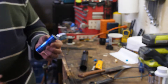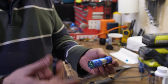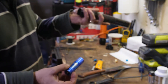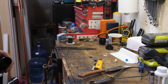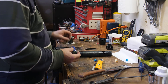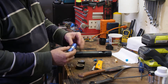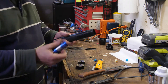These aren't standardized — manufacturers make them in all kinds of different dimensions, that's if you can find them. You can see I've got quite a bit of slop between the maglite body and the rest of the assembly. So we're going to pull out the secret weapon, which is electrical tape. All we need to do is wrap a few wraps of electrical tape around that until it's just snug in the body. I'm not going to do that just yet though — I want to take some measurements first.